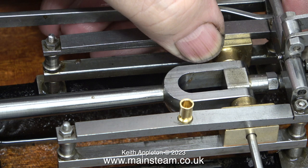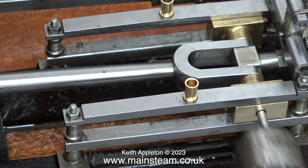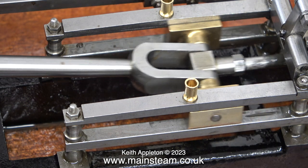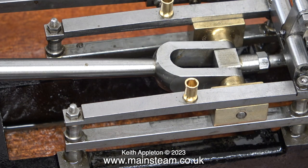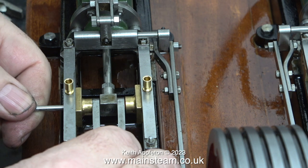Generally speaking, steam engines are hard bearing devices. They seldom use any kind of shock absorption, and one problem with many steam engines is sideways rattle. In this part of the clip, I'm very gently tapping the pin into position. These O-rings, apart from preventing sideways rattle on the crosshead, squeeze the crosshead pin and stop it coming loose. One down, one to go.